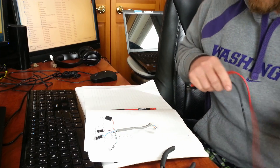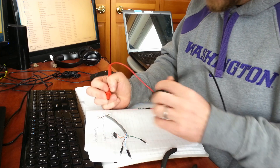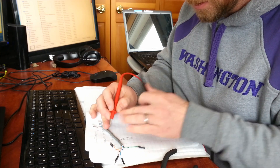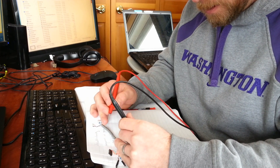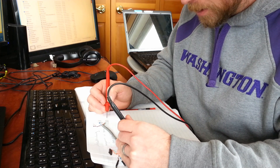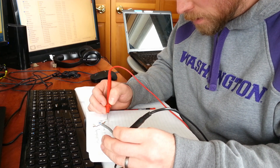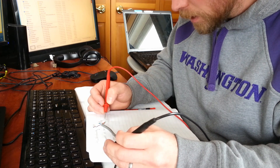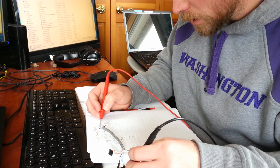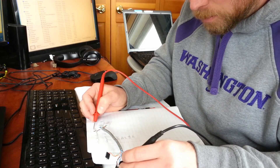I disconnected the main signal cable from the board that I made and I'm testing signals — I've tested the voltage on the board for the signals that I should have, and they're there. The analog signal is good. That connector's good. That connector's not good. That one's not good. That one's not good. The one wire sensor's not good.